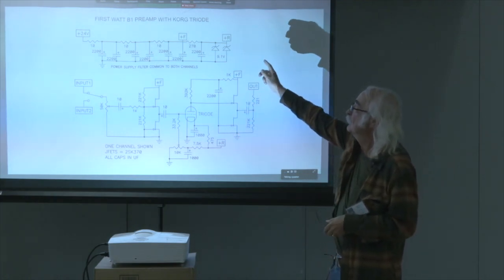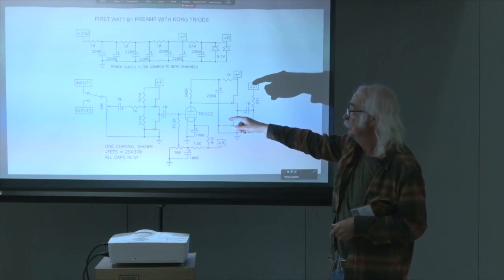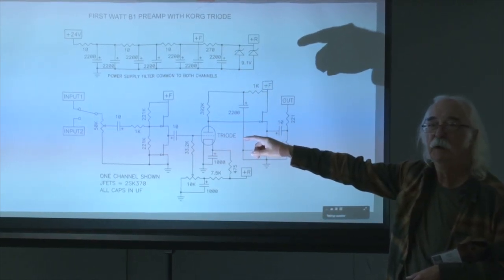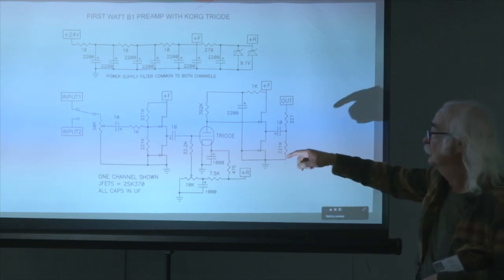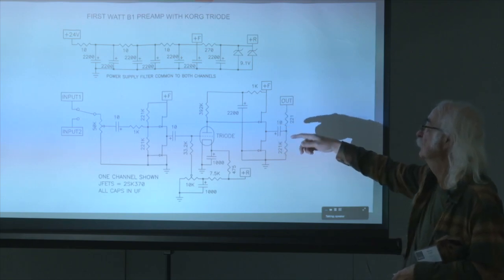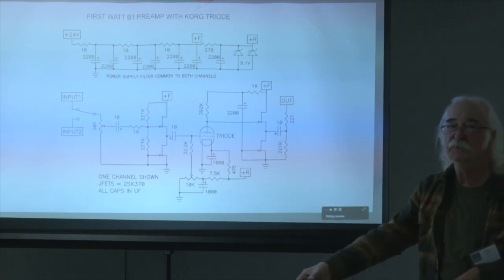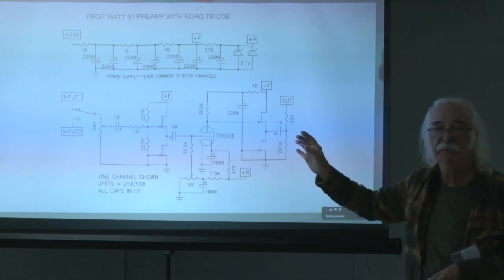Here it is here. You've got a power supply and some filtering and stuff. This is yanked off the article, which is just sitting on DIY audio. You can get the whole thing. There's an input buffer consisting of a FET, and it's not there for any particular purpose other than to take care of the fact that there's a 50K input pot for the adjustment of level. I didn't want to present the triode with such a high impedance because it draws a little bit of current. Here's the triode, and there's two of them, so this is like two of these guys. It follows a JFET buffer at constant current source, and it's just a follower, and it goes to the output. Real simple, runs on 23 volts. It has an adjustment for the waveform, a little 10K pot that you can adjust, and it sets the operating point of the triode, and there's a particular voltage that you want to put it at, and that's in the documentation.